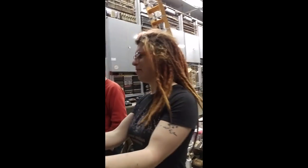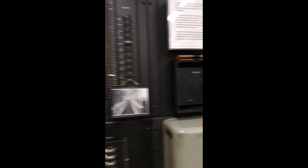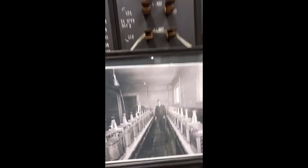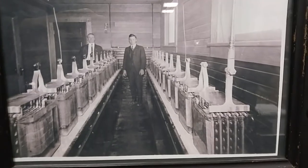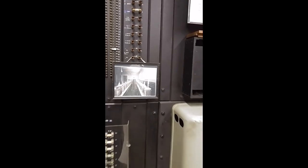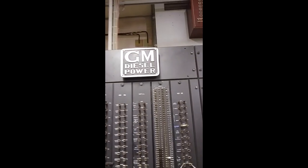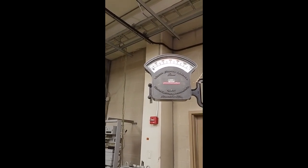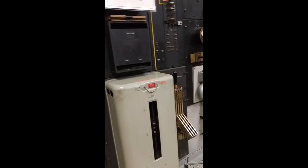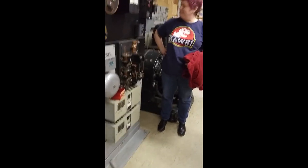This is a part of the power board. That's the battery bay right there. The central office still runs on batteries similar to that. You'd get three-phase AC in from the utility, and then converters would convert that to high-amperage DC that would run through the batteries to smooth it out. Here we have two 24-volt converters, and around the corner are 130-volt DC converters.